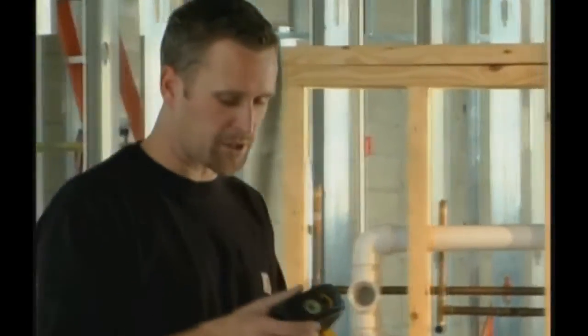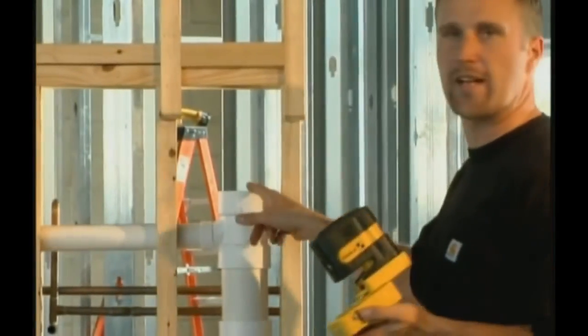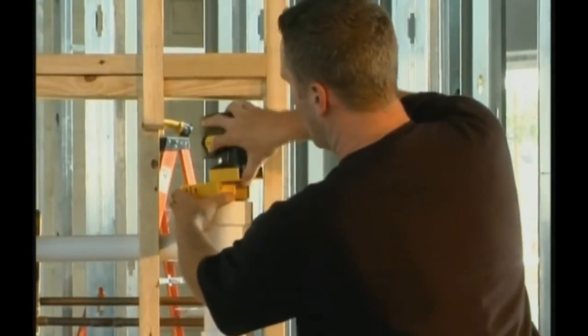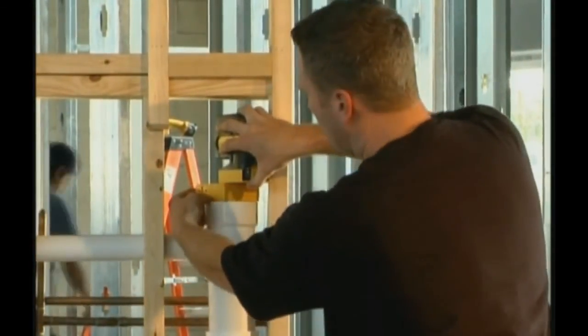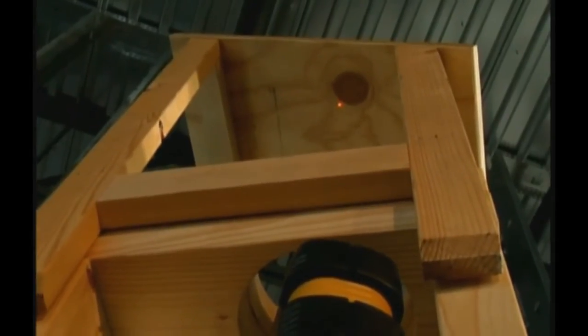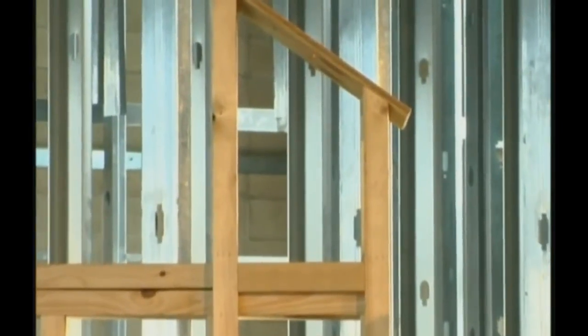On the model here, I'm going to show you how I can drop this laser into a three-inch fitting and it will self-center that beam. Pop the base on top, flip the switch, turn it on. Now the laser self-levels, giving the plumb point of where the pipe is going to penetrate the roof.